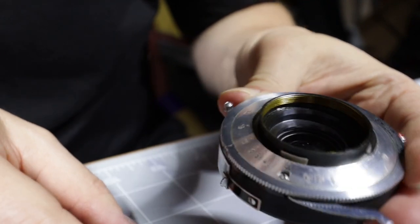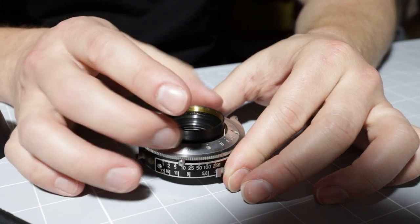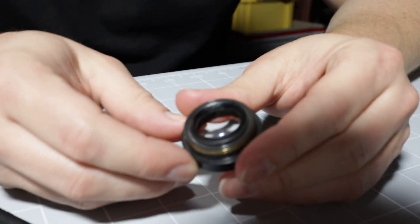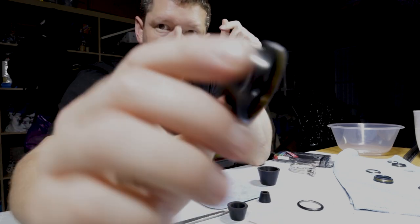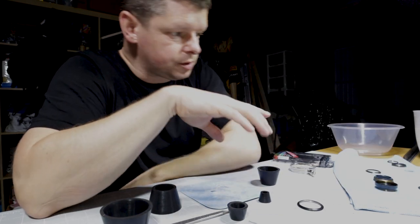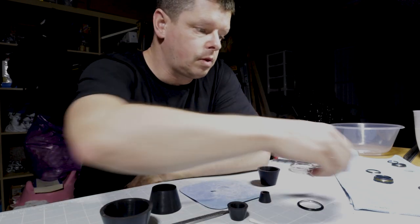There is actually more glass in there. All that's left now is the bare shutter. I'll put the shutter aside — and this is where all the fungus is. Can you see that? Look at that — there's a good healthy growth. I can't figure out a way of getting this last piece out of its frame, so what I'll do is create the solution we're going to put everything in, put those two freed lenses in, and then I'll do this one with a cotton bud.